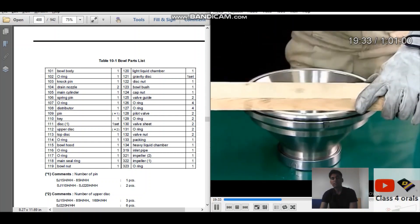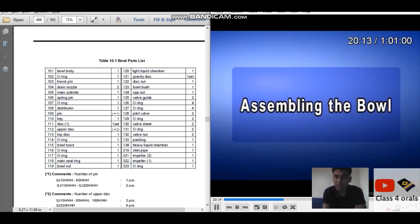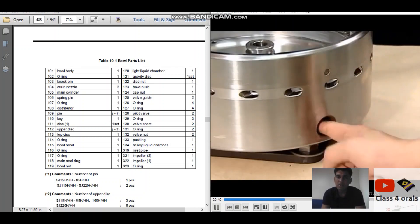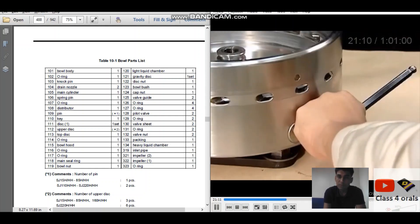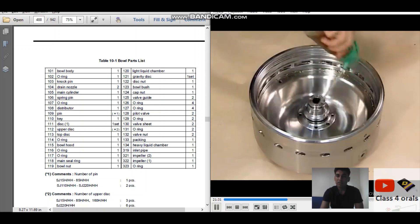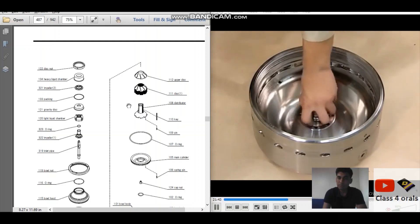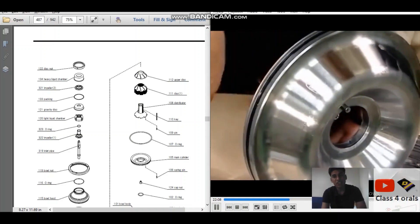The boxing back procedure is entirely the reverse of the overhaul. This is the assembly of the bowl — this is the pilot. All parts have been renewed with new o-rings and lubricated. Now we have to tighten it and mount the cylinder in reverse order. But before that, we have to oil the parts so there is no friction and the parts go in easily. After that, we have to put the operating slide back and match the parts with the dowel pins.